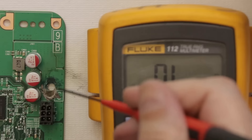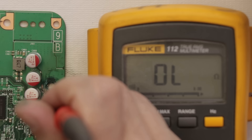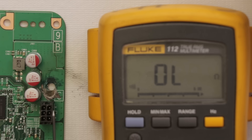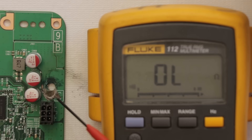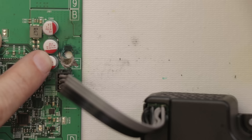I dug out a whole bunch more around here to make sure there was nothing touching that shouldn't be. I think I've got it dug out enough — I don't see any shorts on our power connector. The ground plane shows continuity and all of these show open loop, which is good. I'm going to plug this in and leave this part open so if it does anything, we can watch it. We've got our power supply plugged in — let's see what happens.